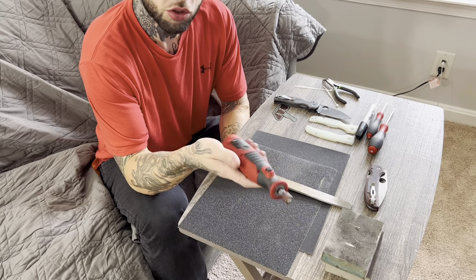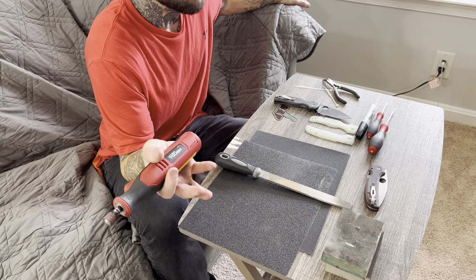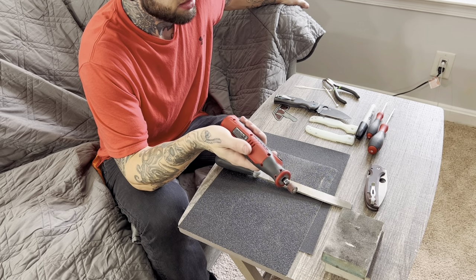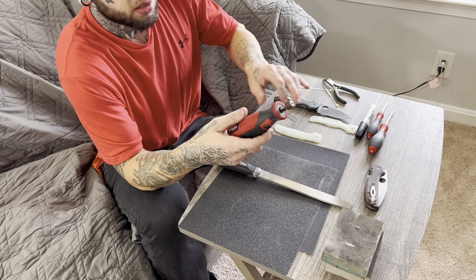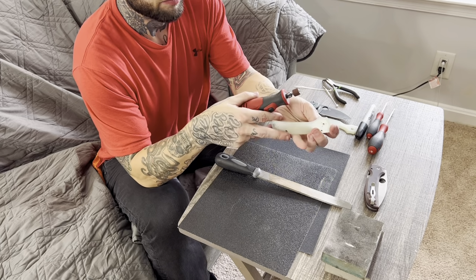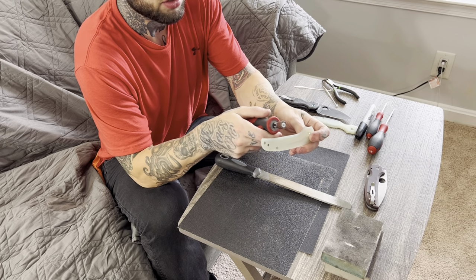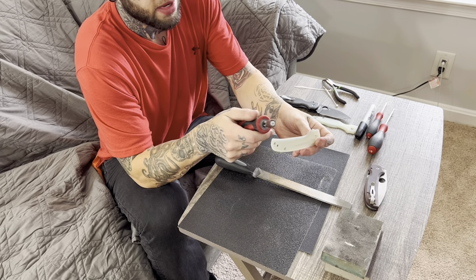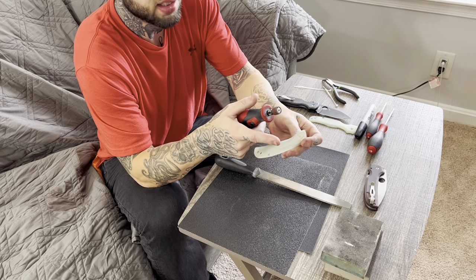I have partially used a Dremel for it before. I know what you're thinking, why don't you just use the Dremel? That'll be quicker, easier, etc. Well, that's not actually the case, and the Dremel can actually make your job a little bit more difficult. Because of the diameter of this drum, it tends to leave a lot of uneven patches, okay? Unless you are a very, very experienced Dremel user. I mean, I use Dremel all the time, and regardless, it's still gonna be difficult to remove that hump and have everything completely perfect,